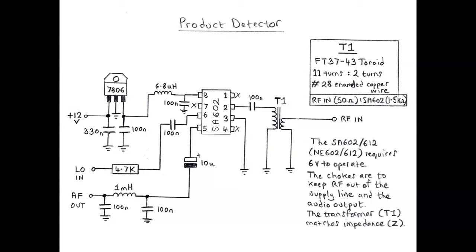And I don't need to tell you guys about it. You're radio hams, you know, if you don't, we're talking about SWR, we're talking about reflected signal. The signal that you want to go through to the next stage, just like with a mismatched antenna, will end up being reflected back and go into heat and everything else. So you'll get much more out of your equipment if you can match the impedance. It doesn't have to be perfect, it's amateur radio, but as close as you can get it.